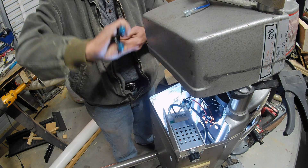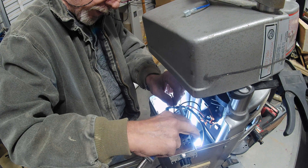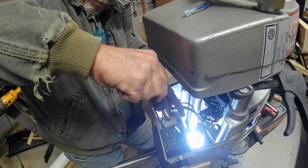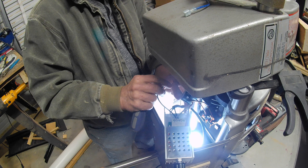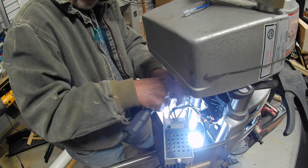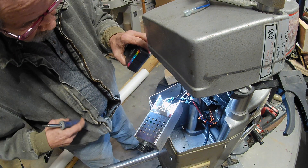Once this works, we'll wire up the reversing switch — we're going to use the center terminal. Now we're going to plug it in to the AC terminal and tighten it up. We've got speed control here, and we've got this wire which is our AC going to the rectifier — it marks AC here. So AC on the rectifier goes here and here. These two are AC and then these two come out DC. So we're going to hook that to that and when we hook this thing up, it should be ready to go.